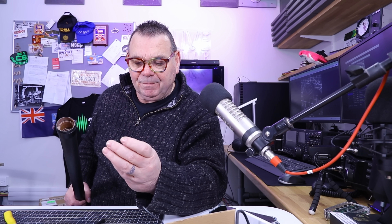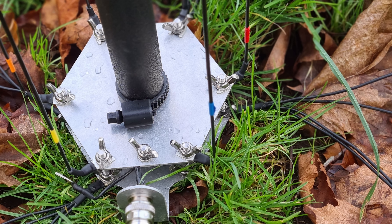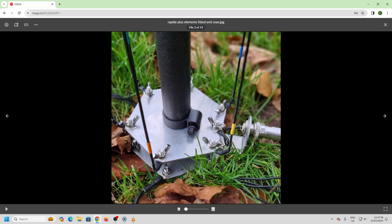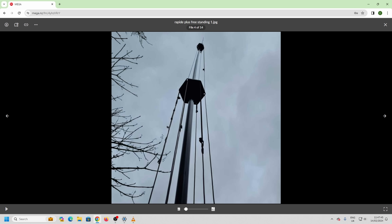Unfortunately if you leave the cap on, it will be pulled up with the antenna and you'll have to disconnect all the radials. Natively in quarter waves it does 30, 20, 17, 15, 12, and 10, and then you get a tune on six meters which Roley sometimes uses on openings in New Zealand because it's summer there right now. I've just run through the pictures I took for the website — this is out in the field right now.